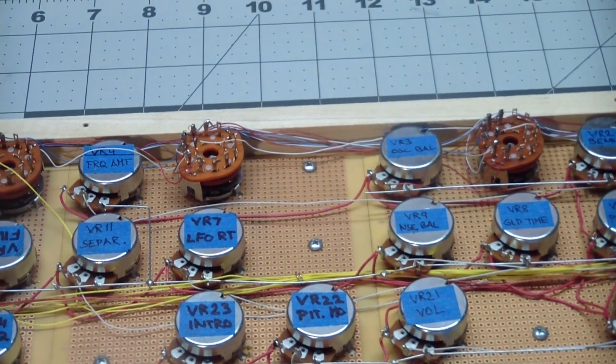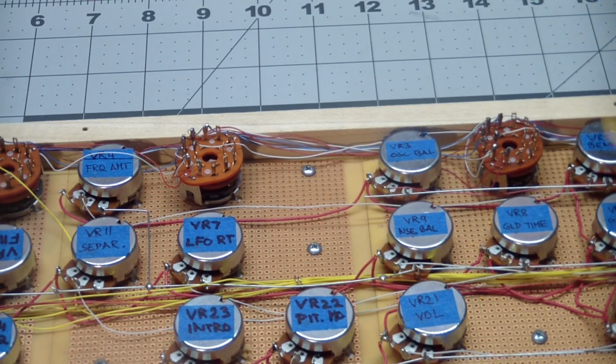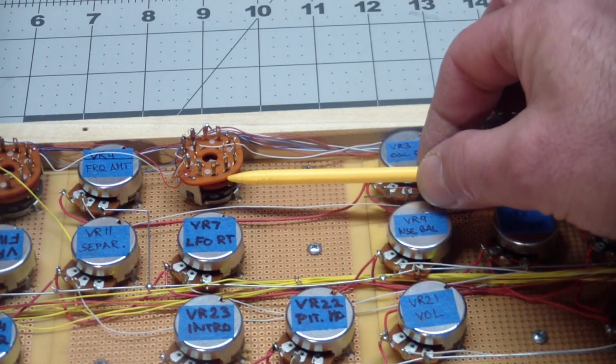And then there's some rotary selection switches, which you also read digitally as if they were several separate switches. The way they're connected is you read them all at once, and then whichever bit is set indicates what the selection is. The original ones were all 6-position rotaries, so you can easily fit that in a byte. Some of these have more. Some of these are 10s, but that's the only thing I could find. I couldn't find any 6s, but it doesn't matter. You can tell these are 6s, because otherwise you would be able to turn the knob past the legends. But they're a double pole, so I only used one pole.